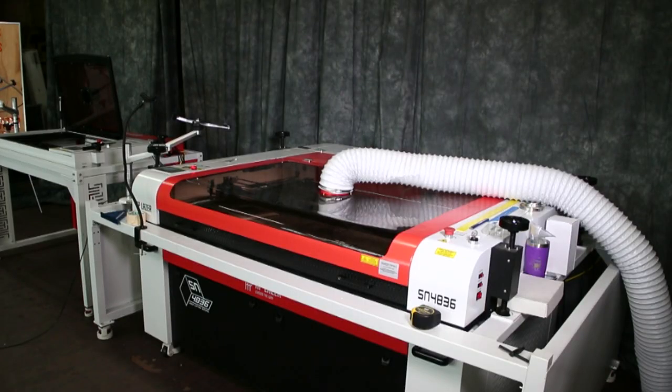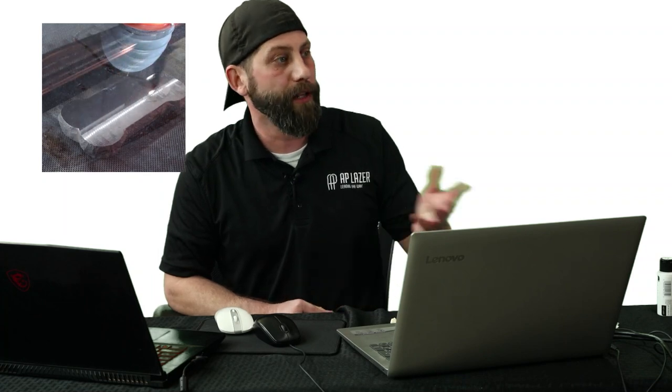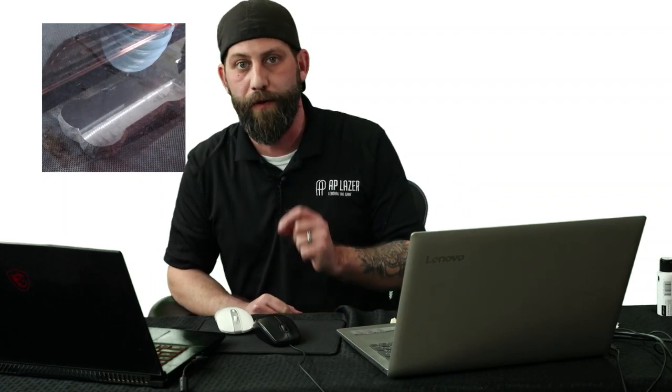Yes, I'm having someone ask, what type of laser am I using and can you do this type of thing with the smaller lasers? Absolutely. I am using a 4836 right now. I do recommend with portraits and things like that, if you have one of the smaller machines, the 1812 does an amazing job with portraits. I believe our last video, which I think possibly got posted yesterday or is coming real soon, we did a portrait on an 1812. Very similar to this process here where we had an actual round piece of slate. And again, we kind of described in that video that the beam size out of the 1812 is a lot finer than my larger machines. So it gives you a nice, crisp, fine dot size. And again, does portraits beautifully.